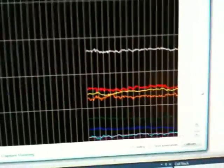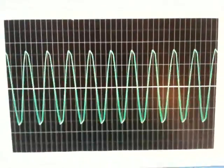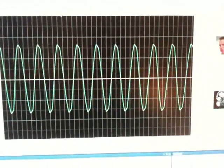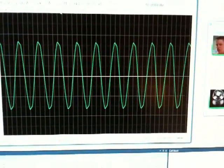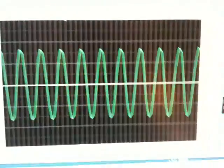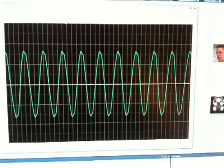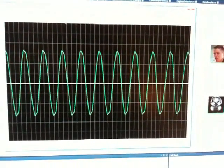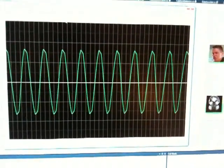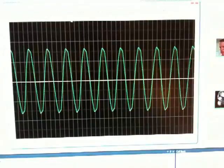Now this is embarrassing — you'll notice here that the harmonics run from about 0 to about 3%. We'll come back to that in a minute. Vectorscope display — we've seen that before. Flicker display and spectrum display and waveform display. I have a little apology to make to those guys such as Narcote who have commented on my previous videos. I made an unfortunate mistake — this is in fact the power waveform. The problem was incorrect connection of the transformer to the sound card. It turns out I used a four-ring jack, so three inputs to a jack plug. The video connection, which I hadn't used, is actually used on my sound card as the ground, so the signals were ungrounded and were capacitively coupled, which is why they looked absolutely bloody horrendous.